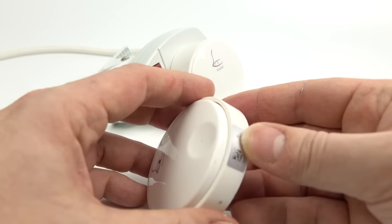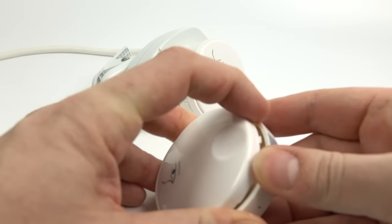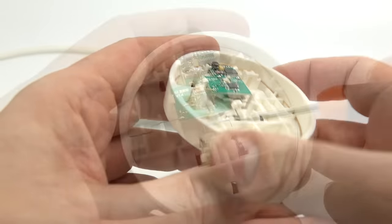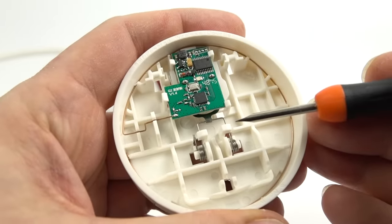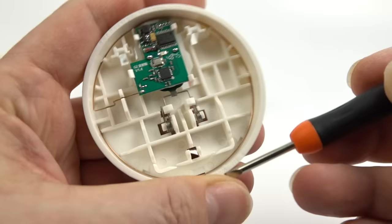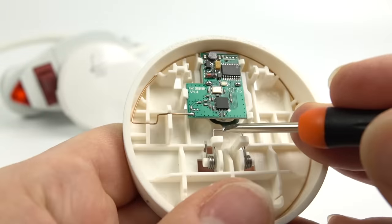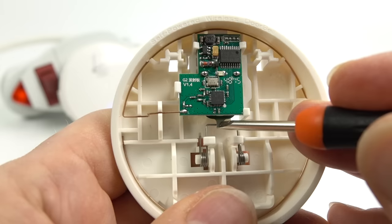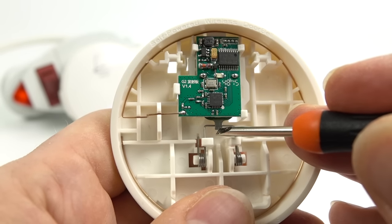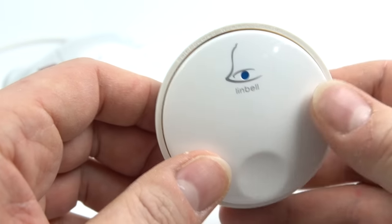I can open this one without worrying about damaging it — the other one is of course stuck to the front of the house at the moment. There's not an awful lot inside as you can imagine. The first thing you might notice is the wire coming out of the left-hand side of that circuit board going all the way around — that's the antenna, and as the specs say, it'll get a hundred meters, which definitely reaches all over my house without any problem. When you press the button on the front it pushes that little thing down, you hear the click, and I'm assuming it's a piezoelectric transducer that's generating the electricity. There's also a little flash on the front of the bell.